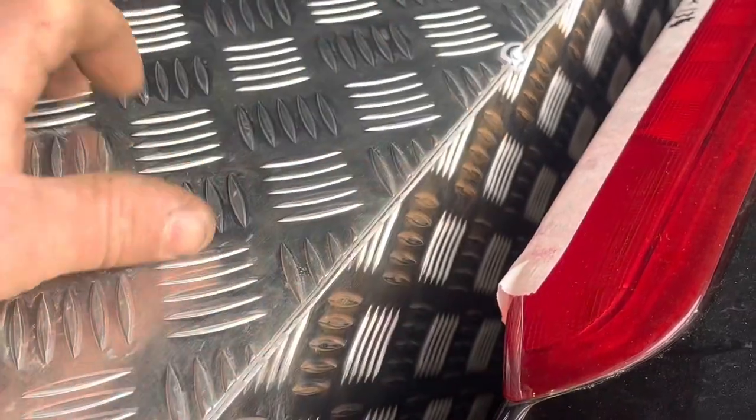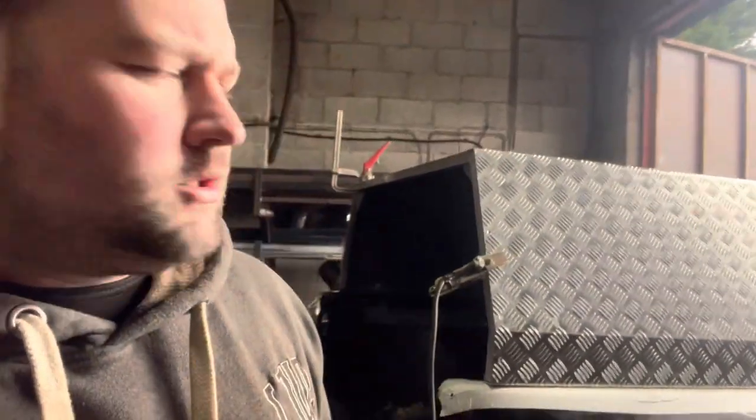We've got this edge pretty nice and ready for a weld. That's on. Ben still hasn't turned up - must be big nails. So I'm going to have a go at doing this back door, try and get that somewhat in shape and then he can start swinging that when he turns up. I'll weld right round the front and right round the back. If I can get the cappings on - door has to go on first, cappings on after - then it's the lock and we're done. I think it's coming along nicely, I'm happy with it.